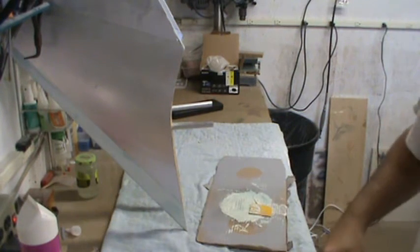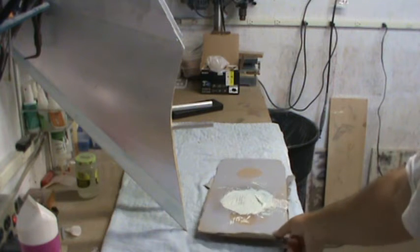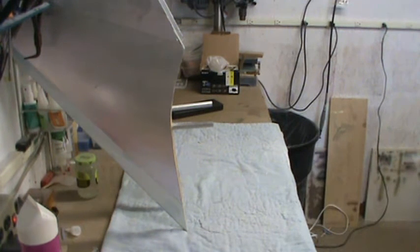That's one way of working with lithoplate — there are a whole lot of different ways to work with this stuff. I'm going to do some work on the wings today as well. I originally had plans to fill the entire top and bottom surface of the wings with body filler just to make life easier and sand it down. But with all the hatches on top of that wing, it's probably just as easy to do it in multiple pieces of lithoplate. Unfortunately you can't do it all in one big piece, but that's something that can be fixed during the finishing process.